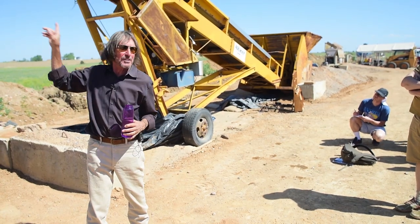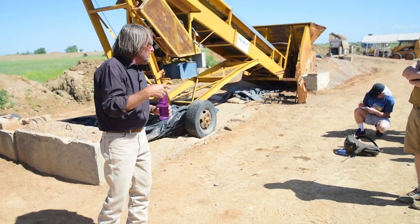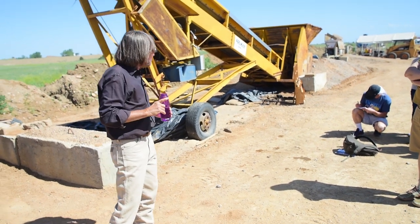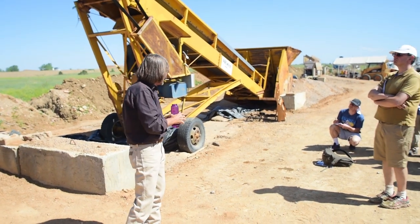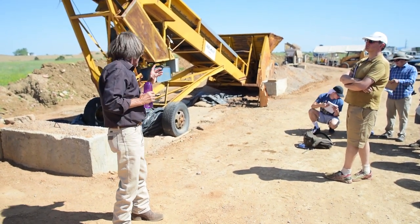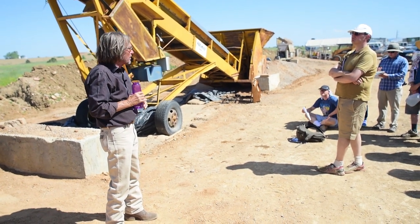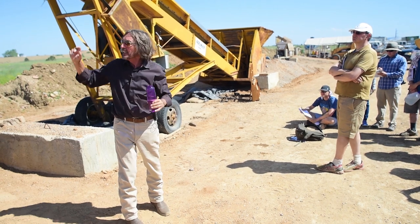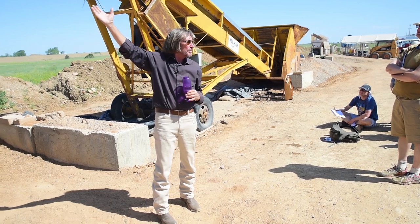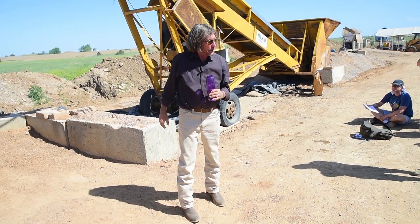My favorite dimension has always been 3/8. That's what we used in Baja, and what I've used in Texas was a 3/8 screen. So we were told that the screener, which came from over there, that the guy that had it over there had a 1/2 inch screen that we could have. So this winter, while we were gone, we had the quarter inch screen taken out and the 1/2 inch screen put in. It's too big. 3/8 is just right.